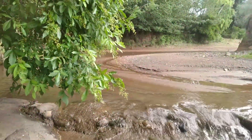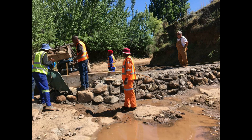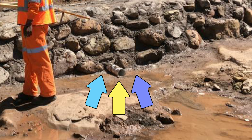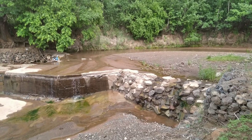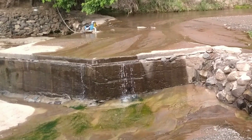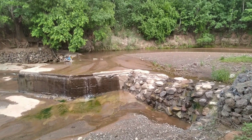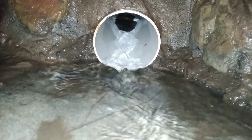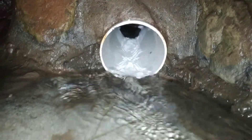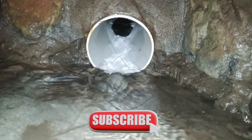So how do we collect the water? These pictures are actually from when my dam was being built, and at the bottom there's a pipe poking through. After the wall was built we added this catchment. It has a storage capacity of about four to five thousand liters, and through that pipe at the bottom is where clean water that has gone through natural sand filtration comes in.